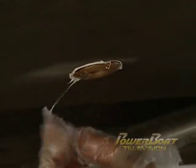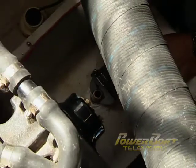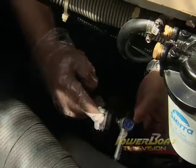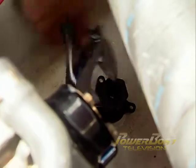The fitting was inserted and pressed into place. Back inside the boat, another bead of sealant was laid around the fitting. The flange nut was then threaded on by hand and snugged down with an adjustable wrench. After applying sealant to the threads on the ball valve, the valve was threaded onto the through hull, tightened by hand, then seated tightly with a wrench.